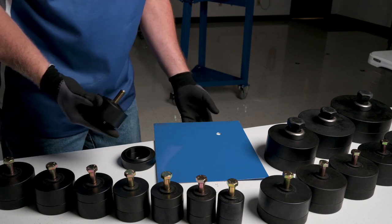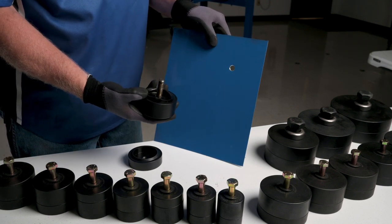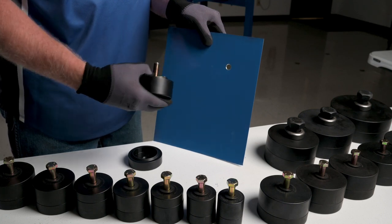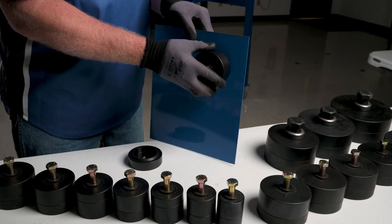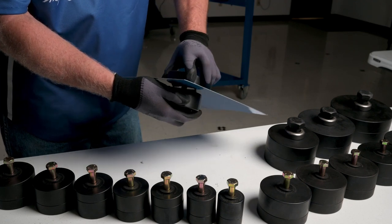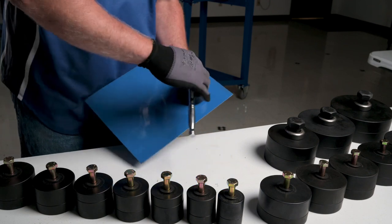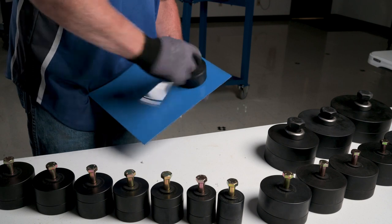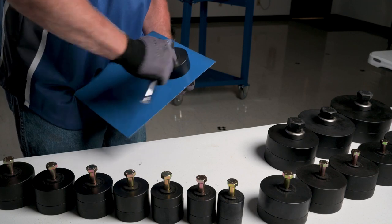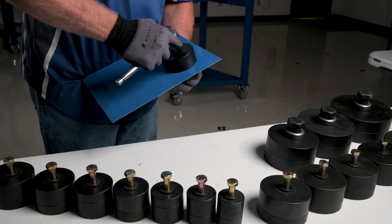Put it all back together. You'll insert this in your panel — the two pieces go through one side and the threaded die part goes through the opposite side. Pay attention to which way the flare is going, because depending on your panel — bent flanges and so on — you want to make sure you're flaring in the right direction. Tighten it down using a socket and ratchet or a regular wrench; a ratchet and socket is obviously faster. We're using 040 aluminum here. You can hear it pop, and then we're doing our flare as we keep going — tighten all the way down until it stops.